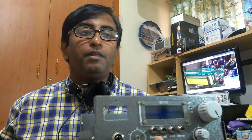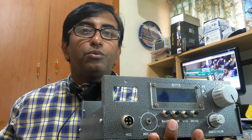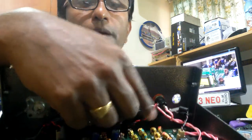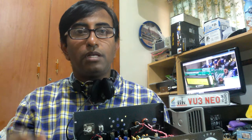Once you've soldered the diode and the power connector and taken measurements, you need to connect the switch. The tricky part is rewiring from the socket. The wire connecting from the socket goes directly to the switch at the center, where you can see the volume control.